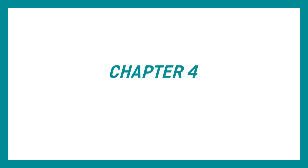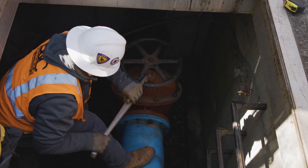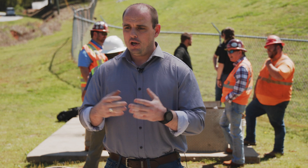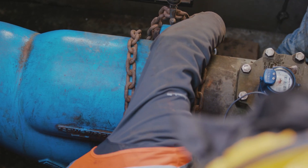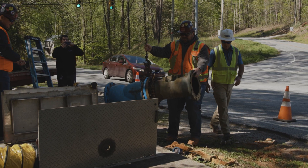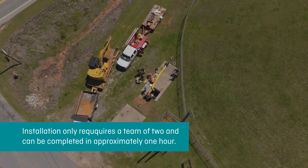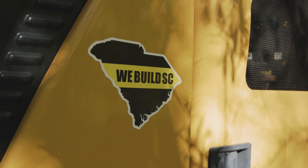With installing the 4200, the first thing you have to do is remove the existing meter that's in the ground, and we found that's actually the majority of the work that goes into the installation process as a whole. When you're talking about water utilities that lack staffing, budget, equipment, and time, being able to go from needing a crew of five people and a crane to get the installation done, down to two guys with a back strap — with the total installation taking about an hour — that really helps our customers out from an ease-of-use and quality-of-life perspective.